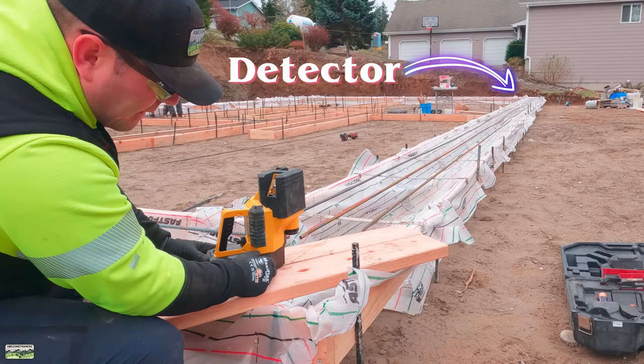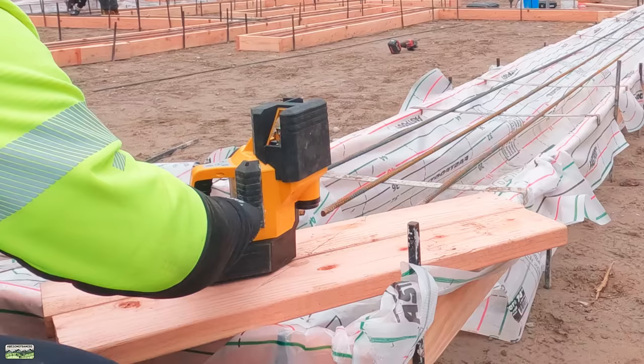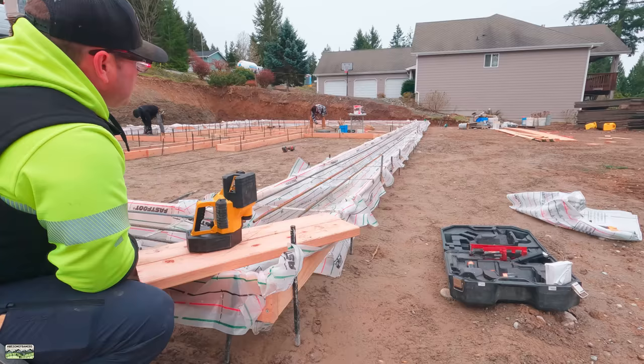What I'm doing here is using the Stabila layout station to shoot square. The detector is on the very far end. I have to have my stem wall seven inches off of the concrete, so I set the detector at that far end seven inches off the back wall - because it's 64 feet, it's our long wall. Then I set the laser on two boards where I've marked a seven by seven, turn it on, let it self-level, the dot is right on my mark, and I manually adjust until I hit the detector. You can use the controller because it talks to the unit by radio frequency and will actually find square by itself.